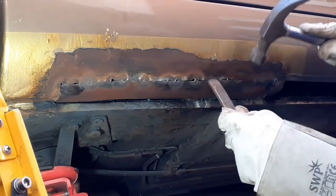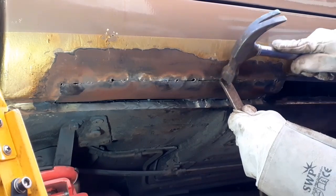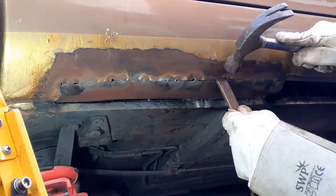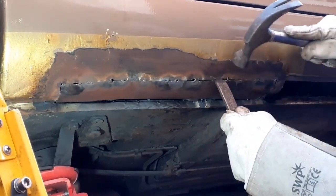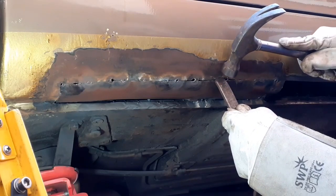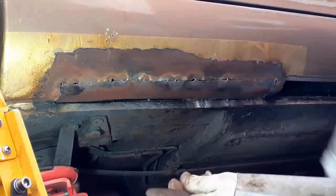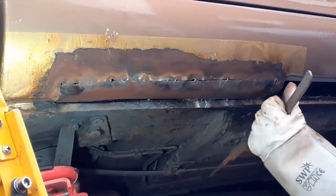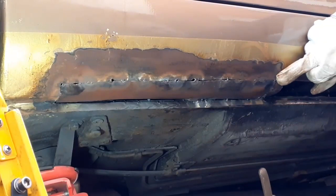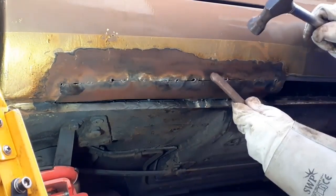That's better. I might spend 10 or 15 minutes doing this. The more effort you make on the panel fit, the less aggravation the weld will be. I'd like to show you a really good weld. If I can spend a good 10 or 15 minutes bashing this about and getting a really perfect panel fit, I'll try and see if I can do a seam without filler wire — just the acetylene flame — and that will be a beautiful weld.